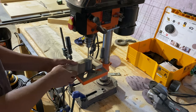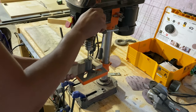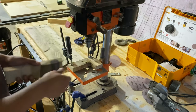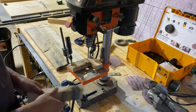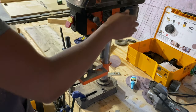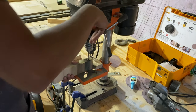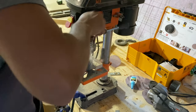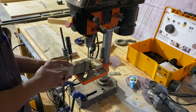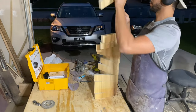Once I got all those cut, I just drilled through-holes that we're going to put the all-thread through, and then these hinges will pivot on that, giving us a way to hang our hats. While this is a pretty DIY-friendly project, having a drill press is pretty essential. There are some jigs you can use with a handheld drill, but getting these drilled at a perfect 90 degrees is pretty tough with a handheld drill, so it's not totally DIY — sorry about that.